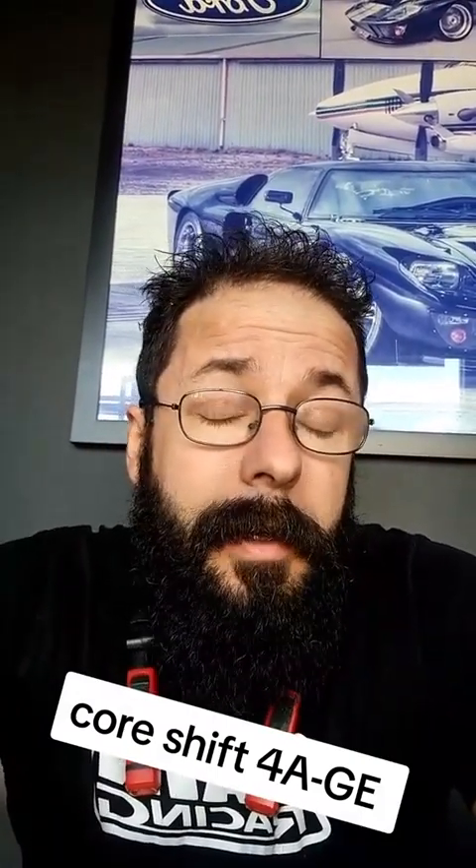So you saw me cast the Honda the other day - it wasn't actually a K20, it was a 2.2. We've cast the 4AGE and we're going to do a little bit of maths and show you step by step through the process of how we establish cross-sectional area for 10,000 RPM. Not that it's any record-breaking thing, but just to give you a rough idea of how we tackle it. What I wanted to explain today is port design, core shift, and a couple of other basic principles that'll help you understand the difference between a good and bad port.